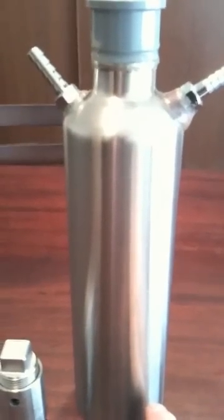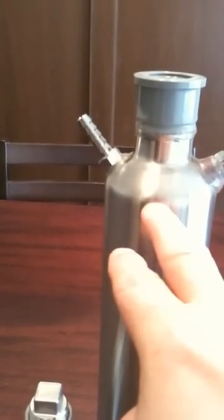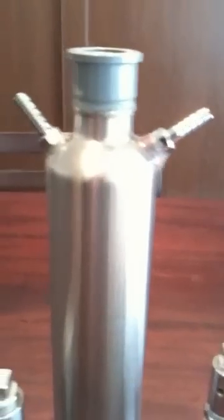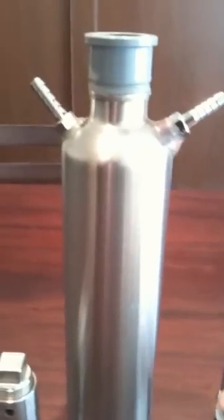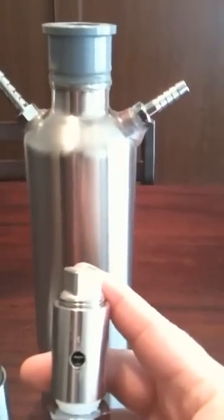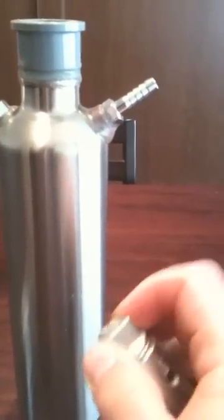That tube at the end has a small aquarium stone which diffuses the bubbles, and they bubble up through the water. The water level is about right here. The gas bubbles out through here and then goes through and on to the flashback arrestor. This bottle will accept a quarter-inch flash suppressor, and it is also very unique as well.